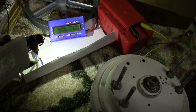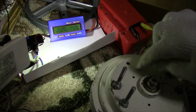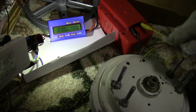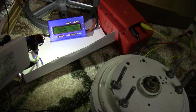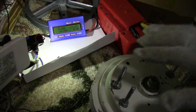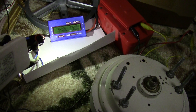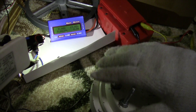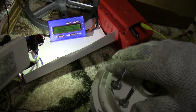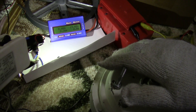I'll call this segment: ceiling fan motor reality check. This ceiling fan motor has a short circuit amp for one phase of 0.5 amp. There are two phases, so the most you can get out of it is 1 amp. The voltage can run very high — up to 50 volts — so theoretically you can get 50 watts out of it.